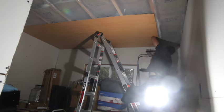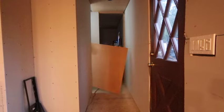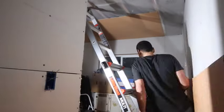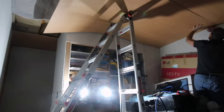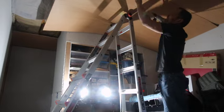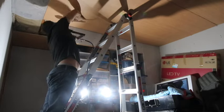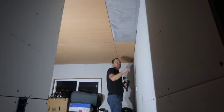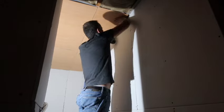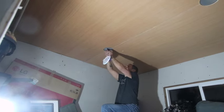This room is just about a half inch shy of eight feet wide, so I put one panel against the back sidewall and cut a half inch off the next one — didn't even need the laser measuring device to find the middle. It's nice that these panels are flexible, unlike drywall, because I couldn't get drywall sheets around that corner. In the back corner there was some mallet manipulation. These two front pieces needed a little section cut off because of where the roof trusses were, and they fit in perfectly. With a little furring strip to cover the gap, my ceiling paneling is done.